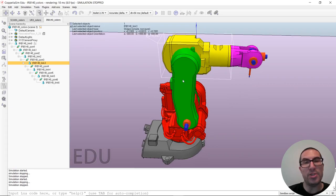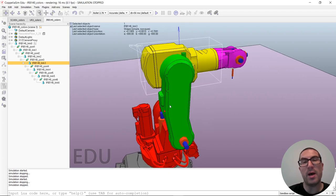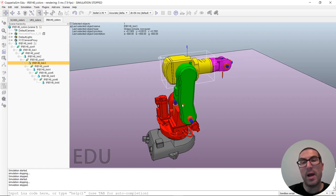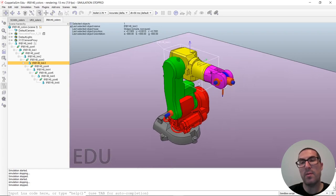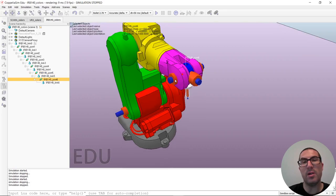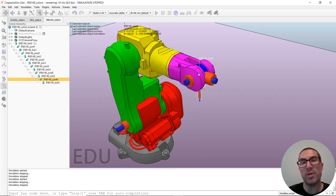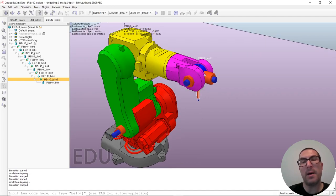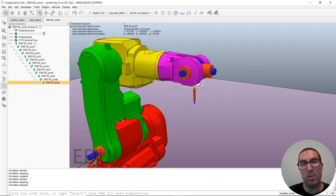Joints 2 and 3 are usually horizontal. The first three joints of this robot are designed to control the position of the wrist point. The wrist point is a point in the middle where joints 4, 5, and 6 intersect — this is called an inline wrist. It's very important because with the first three joints we can position this point, while the other joints allow us to rotate and orient the tool.